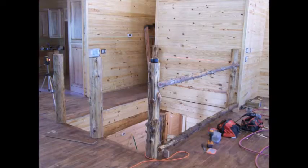The guardrails at the top are 42 inches high. That's going to be the height of all the guardrails. The handrails are going to be 34 inches high, and that'll be going down the stairs and around. There will also be a max of 4 inches at the bottom spacing between the floor and the bottom of that rail, and also a 4-inch max between each spindle.